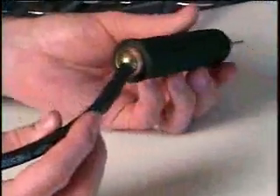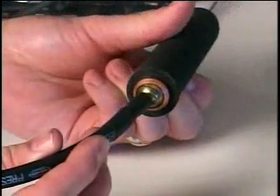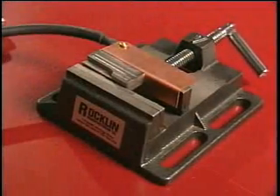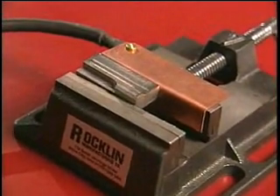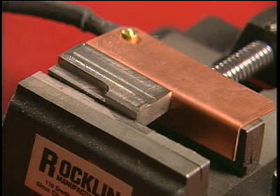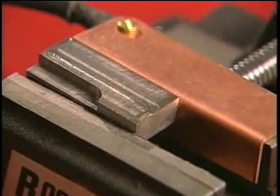Notice that the electrode holder has a unique ball joint rotary cable, which makes the equipment convenient to operate. The next step is to electrically ground the workpiece with the ground plate — this is one of the most important steps. The workpiece must have as good a contact with the ground plate as possible, usually involving clamping the ground plate to a clean surface of the part to be repaired. On large parts, the ground should be as close as possible to the weld area. A heavy part may be able to just sit on the ground plate, but this is not good enough for smaller parts.